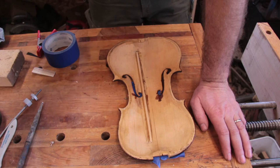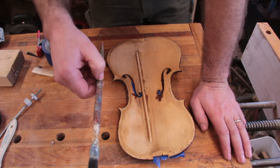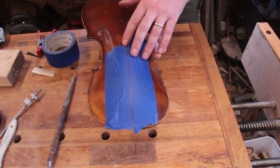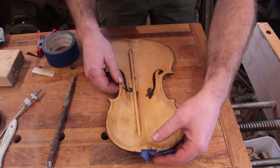I've got it a lot warmer in the shop today — I've got the wood stove cranked and it's probably over 80 degrees in here, so I'm a little bit toasty. The crack closes up pretty good with the clamp. I'm going to set it apart, use a brush to paint on the glue so it goes on quicker. On this side, I've spanned the crack with painter's tape so I can be a little messy with the glue and won't have to peel it off the finish — it'll be right on the painter's tape.